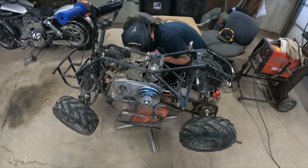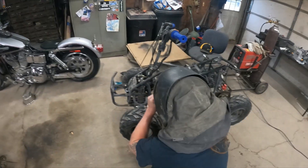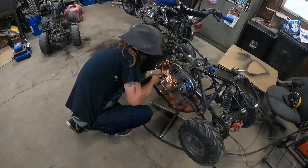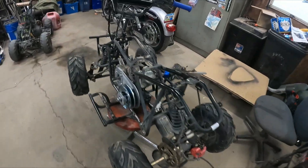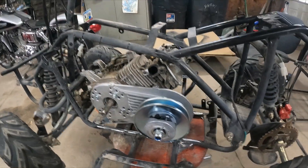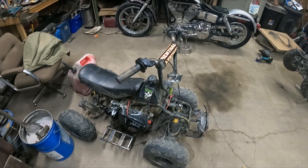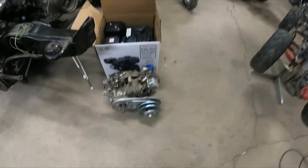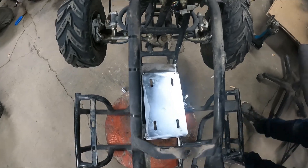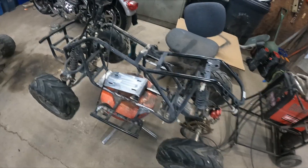She's straight. Jack's packing all the motor mounts, risers, and plates. We'll get the motor pulled off, get everything welded up solid, and start getting the new motor on. Just pulled the chain off - everything's tacked up and ready to be fully welded. With the mock-up motor off, the frame is so cockeyed it looks like the mount is six ways to Sunday, but the motor is going to stay straight. We double and triple checked it - got it all fully welded in.